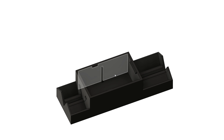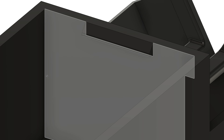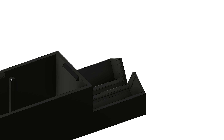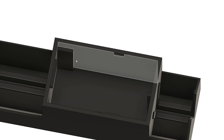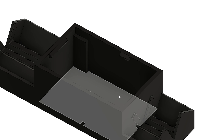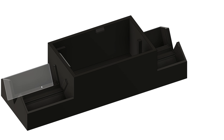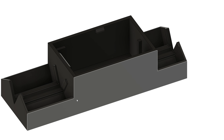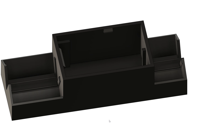Here is what I designed for the five volt power supply. You just stick the PCB in here with plastic clips here, here, and here to keep it in place. There are three spacers from the bottom so the components can fit inside and only the backside of the PCB is exposed. The AC side will be covered with electrical tape. The sides have five-pin WAGO 221 holders and three-pin WAGO holders for the DC side. Let's print this and take a look at the printed part.